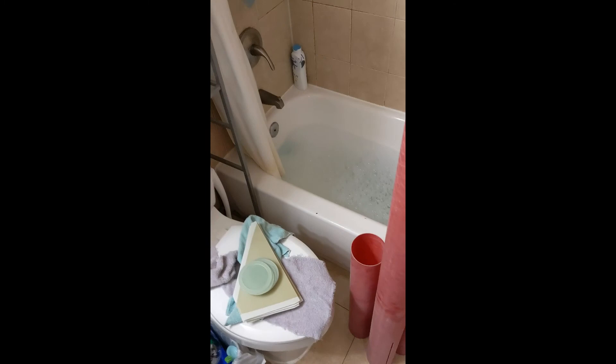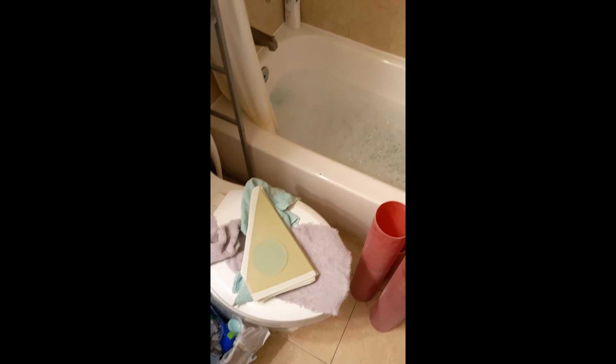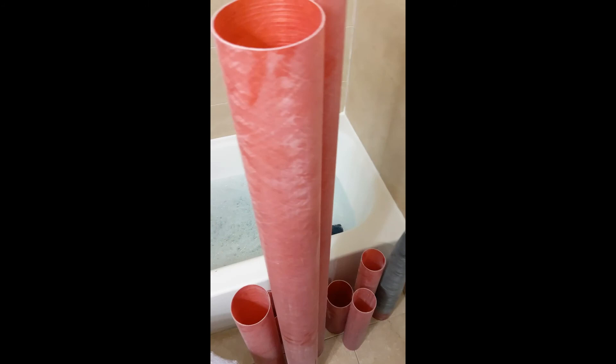I just use regular dish soap for this. I've got my Dawn dish soap here and a sponge floating around in there, and we're going to throw all this stuff in the water. I go ahead and wash my centering rings and my fins as well. I've got six fins here and a whole mess of centering rings and things too. We're going to put everything in the tub, wash everything, and set it on these towels here to dry. We've got a ton of soap in here, so go ahead and be generous with your soap. Just make sure that when you're done washing off the mold release, you rinse everything really good. Go ahead and throw your centering rings and all of your fins in there.